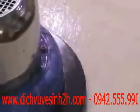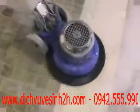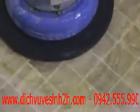So in this particular floor, we went through 3 sets of grinding discs to show you a high polish. And so this is the highest grit, the finest. And this is done just before the polishing process, this grit. It prepares the stone for the polish.